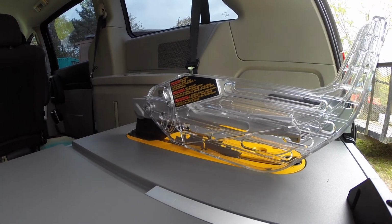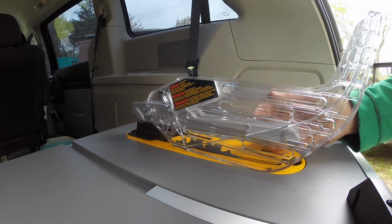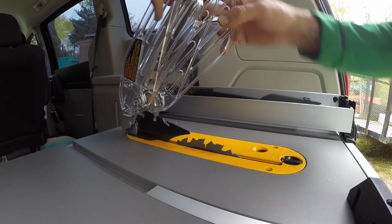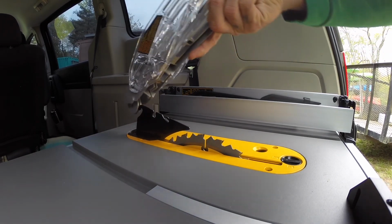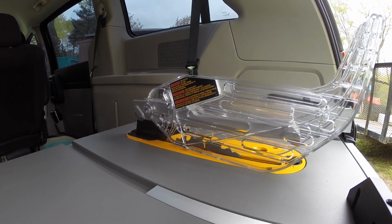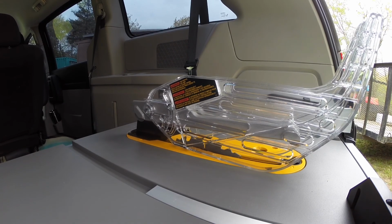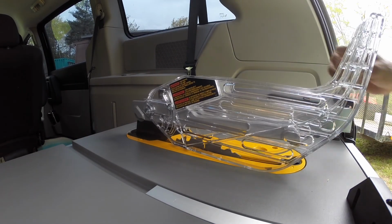I guess if you're trying to do real thin rips, like 1/2 inch, 1 inch, this thing's kind of cumbersome and will probably be in your way. The only thing it says is make sure the riving knife is in line with the blade. Make sure that that is in line with the blade. And then once that thing's unlocked, it comes off really easy. There we go. I'm only cutting 7/16, and ideally you only want as much blade coming out as you're cutting, just slightly more. You don't want a whole lot of excess blade sticking through your cut, waste of energy.